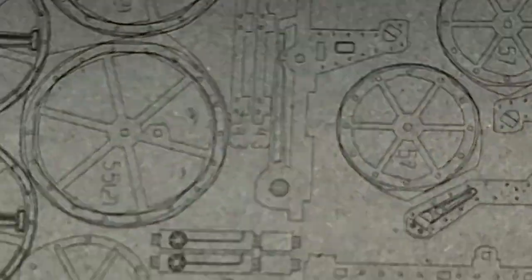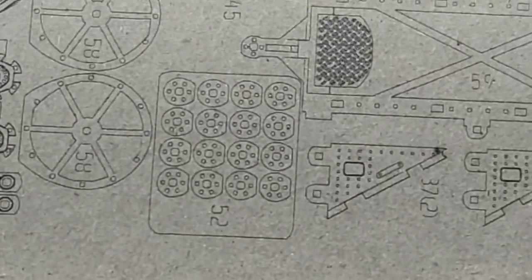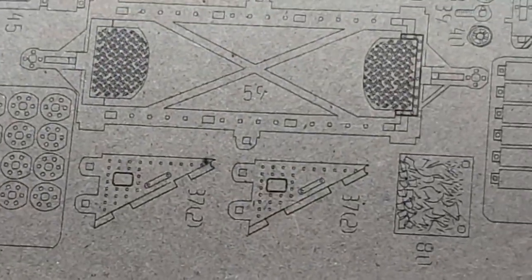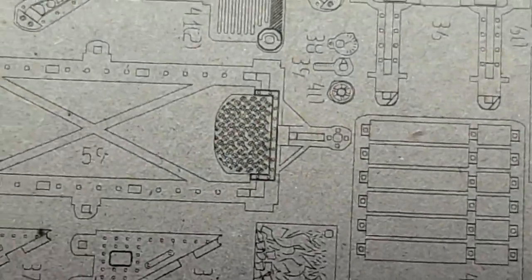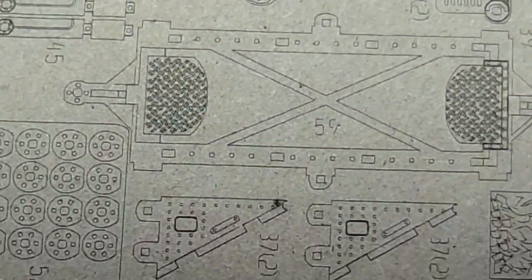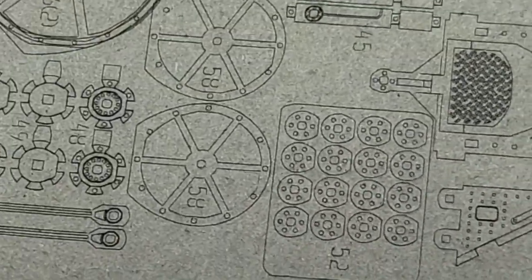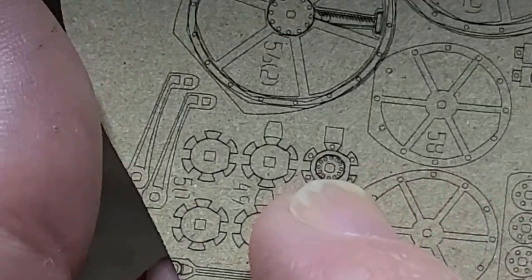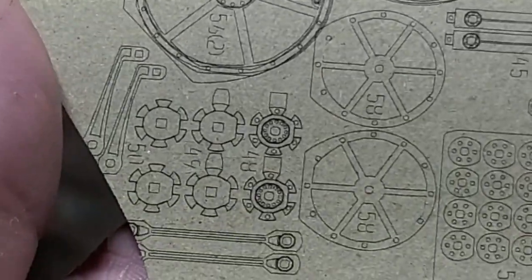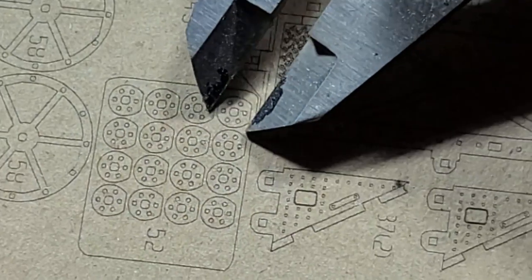Now, this is one that was done at lower laser power. This was only 5% power, but it was also at 500 millimeters a minute, or about 20 inches a minute. And if we look, all the lines are just really straight. The accuracy goes way up, particularly at 500 millimeters a minute and less. It is super precise. All these objects are just super, super well defined. And once again, this stuff is microscopic. To really give you an idea, like one of these little circles I'm looking at here, which has the bolt hole patterns.